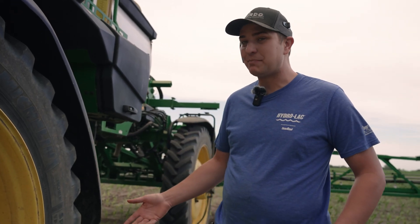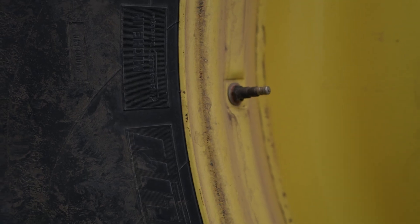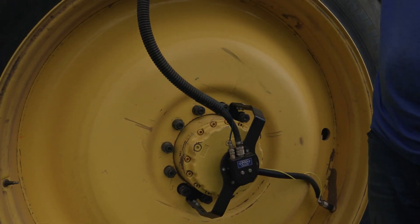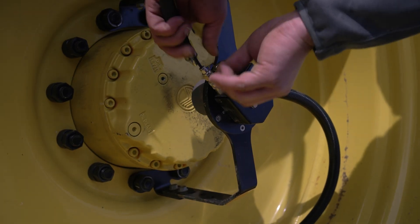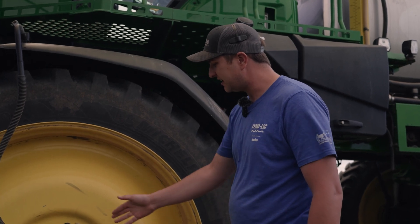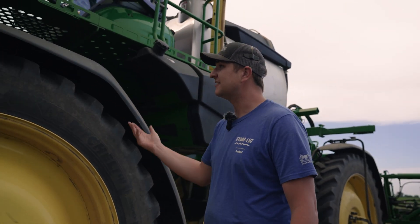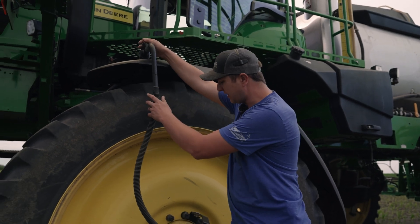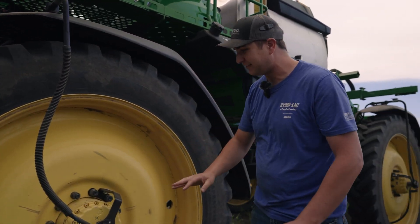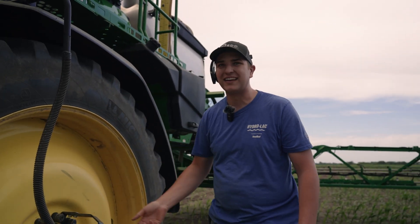The first thing I noticed when they put the system on is they drill a hole in the rim to add the system, so you still have your original valve stem and can use it exactly the same as you normally would. It's got hookups from the air compressor that spin along with the wheel. When I put my floaters on for pre's, we just stowed those up in a storage spot out of the way. There's also an adjustment here so you can position it away from the tire and the crop, and all the hose lines are protected so you don't catch them.